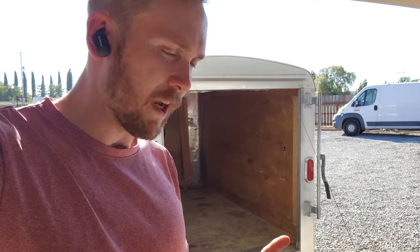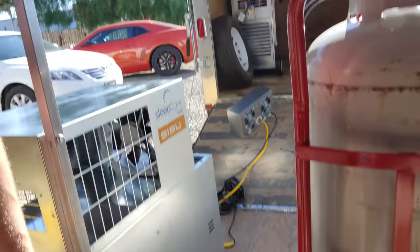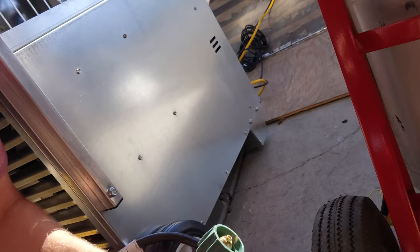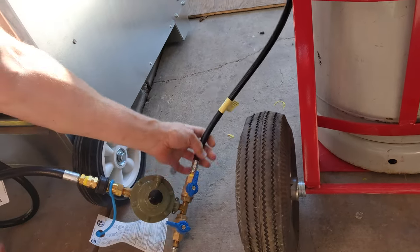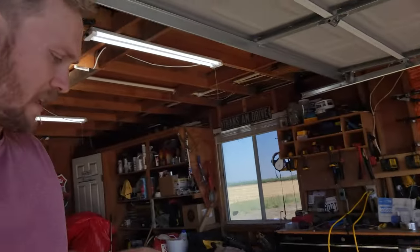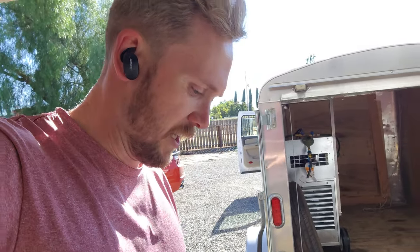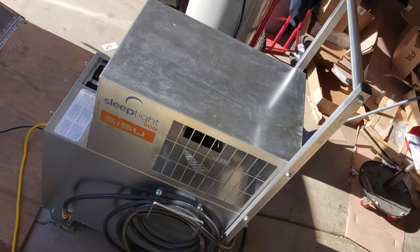What's kind of cool — the first modification I did, which according to the instruction guide you can do — they come with barbecue-type adapters for 20-pound tanks. I put in a five-foot Mr. Heater hose and adapted it so it can thread into a 100-pound tank. That way I don't have to worry about propane freezing up or running out on the job and having to shut down and go refill. I'll always have fuel. It looks kind of cool, kind of sleek.